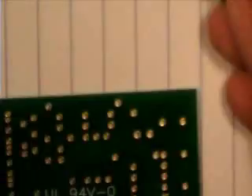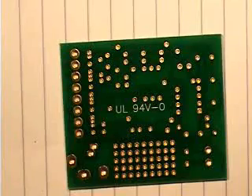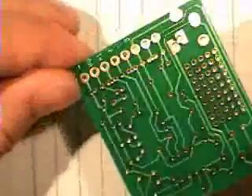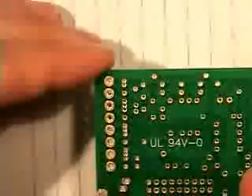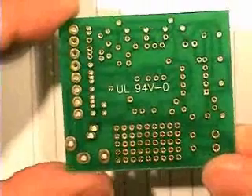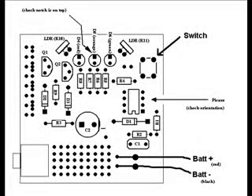And of course we have the Uniboard, which is a single-sided board, but each pin is actually double-sided. So there's only tracks on one side; on the other side there aren't any. And it's that side that's going to be mounting the components. The manual shows the layout of all of the components there.